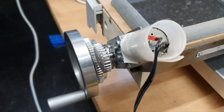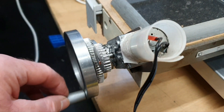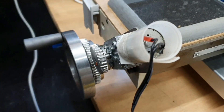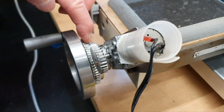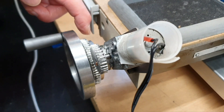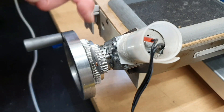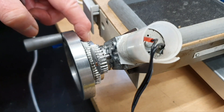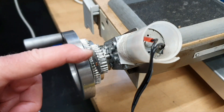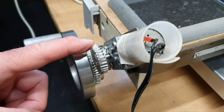This is the setup I used to drive the hand wheel here. I made two gears. There's a large gear here which is actually attached to the hand wheel itself. This is about 62mm in diameter and it's a 60 tooth gear. And on the motor there's another gear here which is about 32mm in diameter and that's a 30 tooth gear.